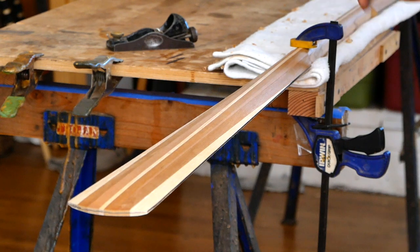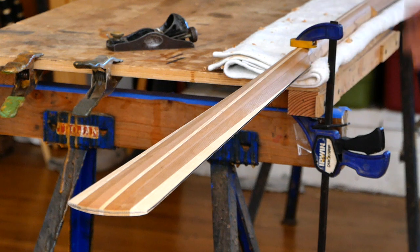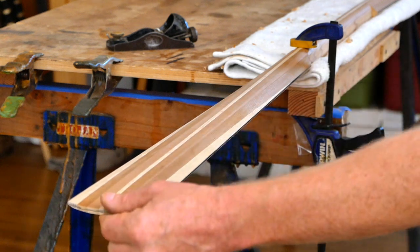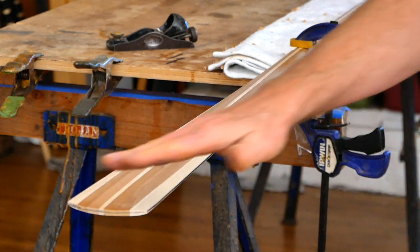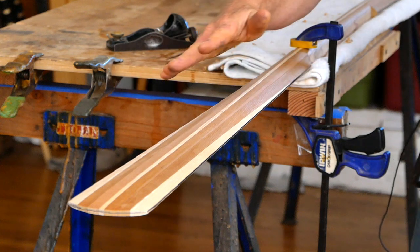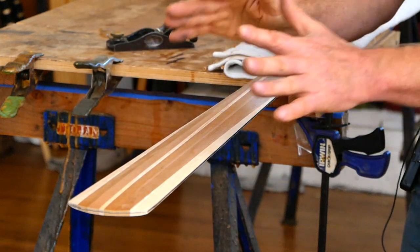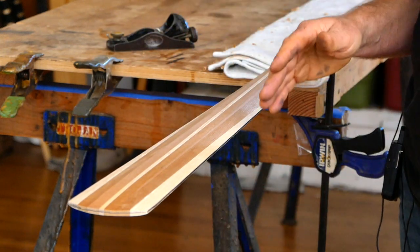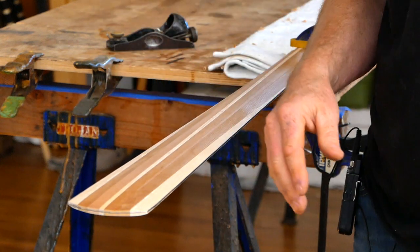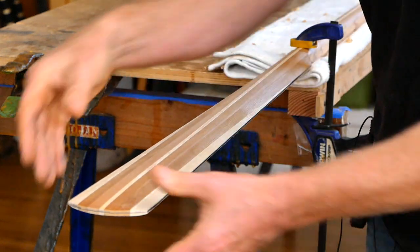Now that we're finished shaping the loom, the next thing we're going to do is take off a little bit more material up here by the shoulder if we need to, and then we're going to measure the thickness of the paddle at three different points along the blade. We're going to evaluate the flex of the paddle and then if we need to we're going to thin it down a little bit more, and finally we're going to finish shaping the entire surface. Note that I'm switching between a laminated paddle and the solid red cedar paddle — it's the same process.